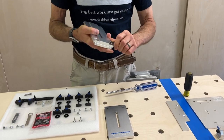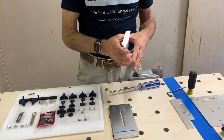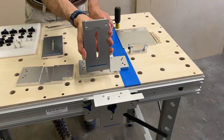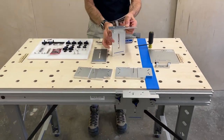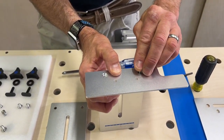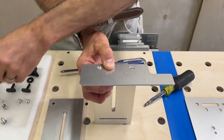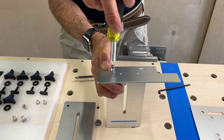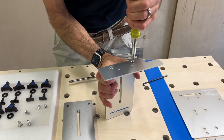We'll just tighten that. So that's the pin block. As we have in the front bracket here, it's facing this way. We're going to put the pin plate on in those two holes right there. That's what these two small screws are for. For this we will use the number two Phillips. I'll just leave the first one slightly loose before I get the other one in. So that's now looking good — we'll tighten that, making sure not to cam out the screwdriver.